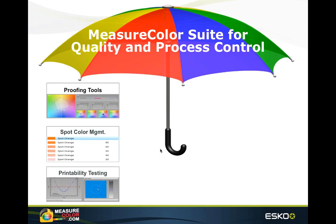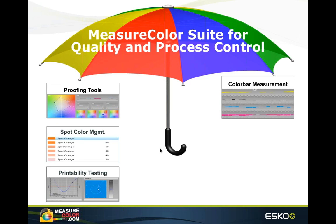Next, we take your colors into what we call printability testing. This is to ensure that the inks on press perform to the optimal delta E that you require to get that color match. Once we've done our preparation, we can go into color bar measurement.